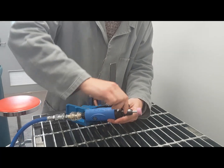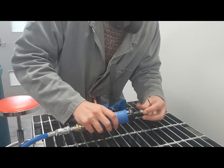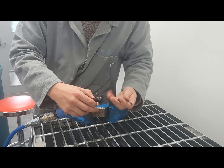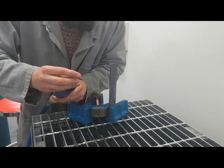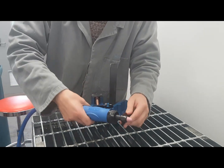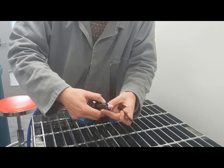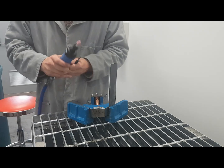Take the smaller C-spanner and put it on the bottom, and the larger C-spanner to pull it on the top. Pull out the tool, twist the top thread off, remember righty-tighty, lefty-loosey, pull out the larger collet, replace with the smaller collet, screw the cap back on, place the tool inside, place the larger C-spanner on top, and tighten while holding the bottom C-spanner.